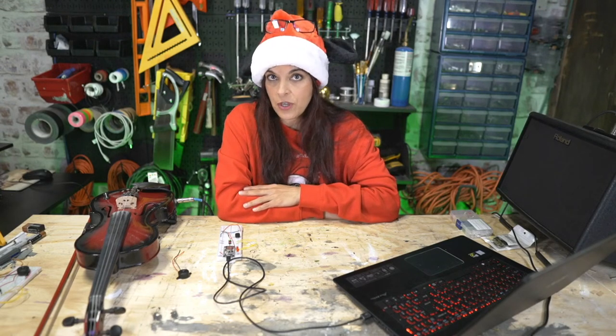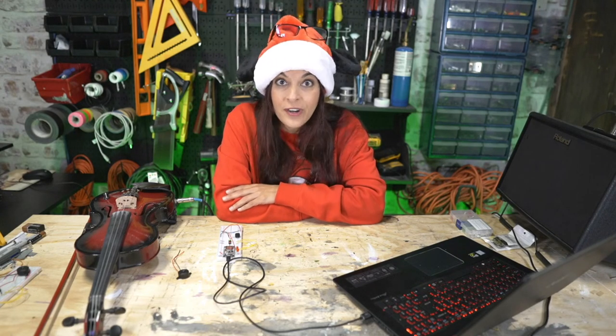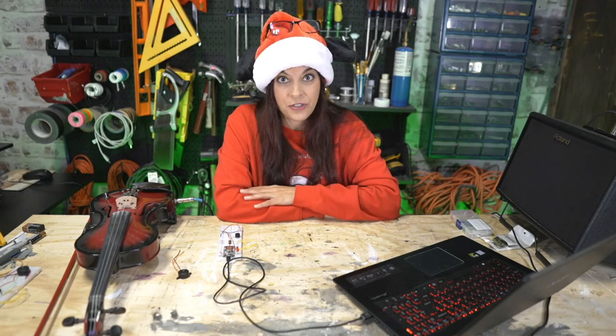So Dave said, are there 87 notes? I think so. I think there were 87. Now, say you goof and you put fewer notes than are in the song. What will happen? It'll only play up to that number of notes. So say you have a song with 100 notes and you put 85, it'll just play the first 85 and then it'll be done. So if you find your songs getting cut short, the very first place I would look is that variable that defines how many notes are in your song.